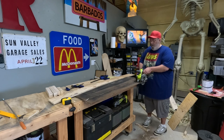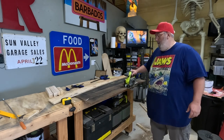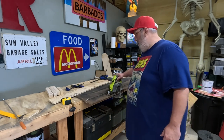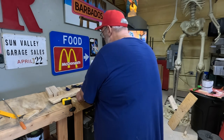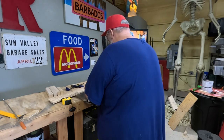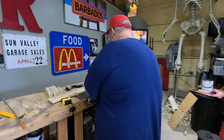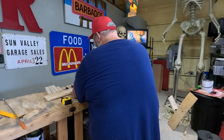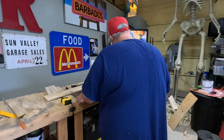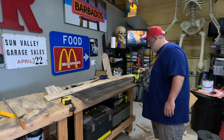Now, in the back of my workshop, I had some spare quarter inch plywood. It's actually not ideal. It has brick finish on the back side, and I used it when I was building a bar in our living room, but it'll work. Once I cut the two strips, all I did was put down a layer of wood glue, put the top strip on the bottom strip, and use some of these clamps to clamp everything together until the wood dried.